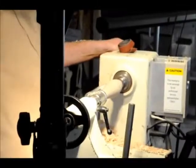There's some marks. When it's curls, you got all that end grain. Every one of those curls presents end grain to your surface. And so there's a spot there, so I can go back up to, what's this? Of course, I sometimes find I start with a fine grain where I want to be, because then the other places show up. If I start with a coarse grain, I'm doing a lot of sanding I don't need to do. So now I can see that spot where that little tool mark was, and I can focus just on that area.